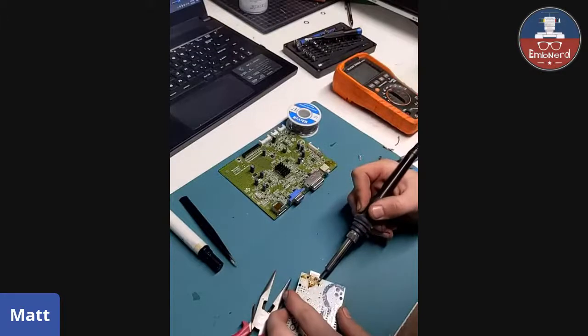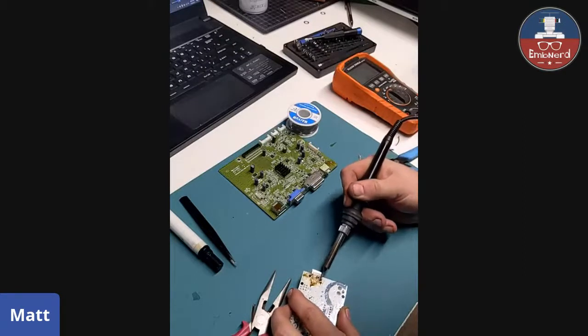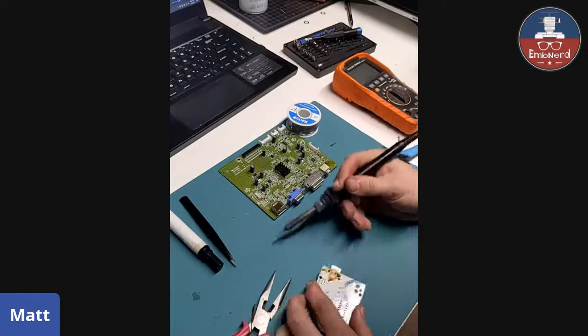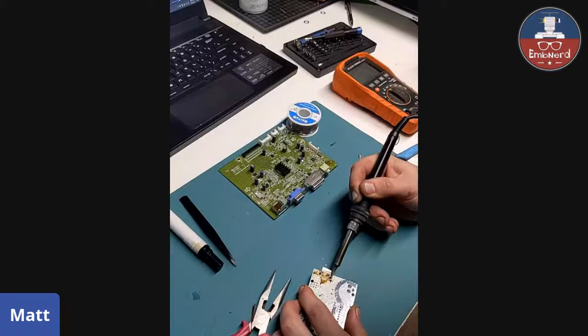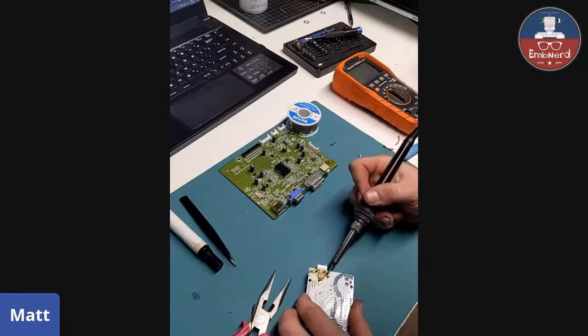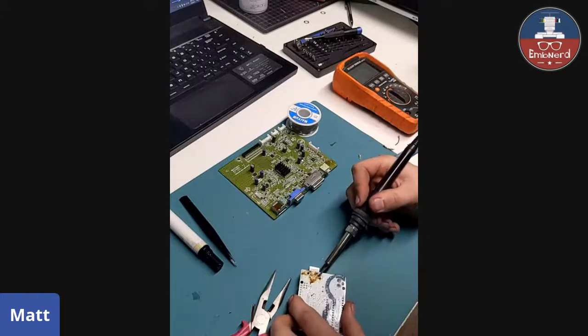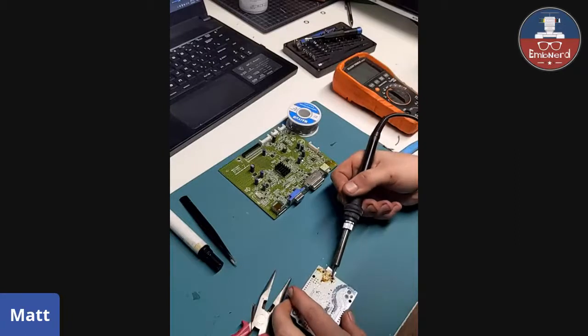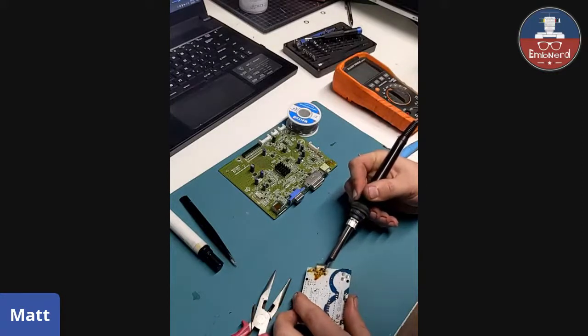Okay, so I think it's just got to get this ground off the edge. Yeah, and I've done this, but my soldering iron is significantly hotter than yours. Yeah, this one is not that great, apparently. I had my wood-burning one, which is also a soldering iron. I don't know what that one gets up to. But yeah, this one only goes 480, which you're supposed to be at like 5-something or 6, I believe. So that's also probably why this isn't working out very well, because I'm having a lot of heat on it for a long time instead of a lot of heat for a little bit.